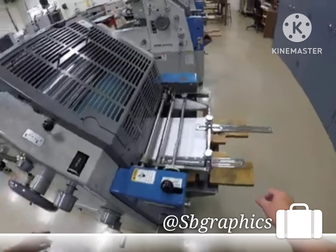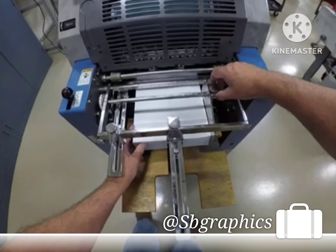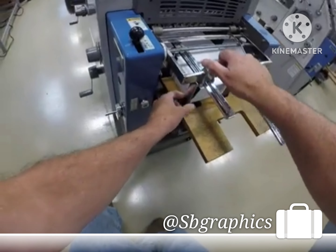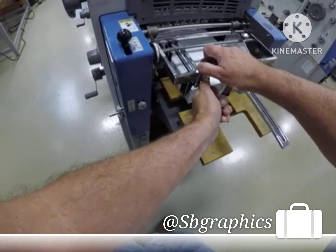The feeder pile has stopped. Bring your side guide over to touch the paper. Bring your springs to touch the paper, but the springs have to be between the wooden slot grooves — otherwise that would jam. Positioning correctly would be fine.